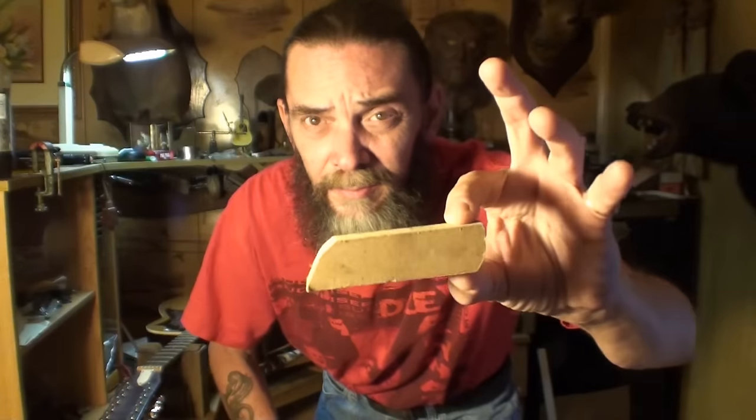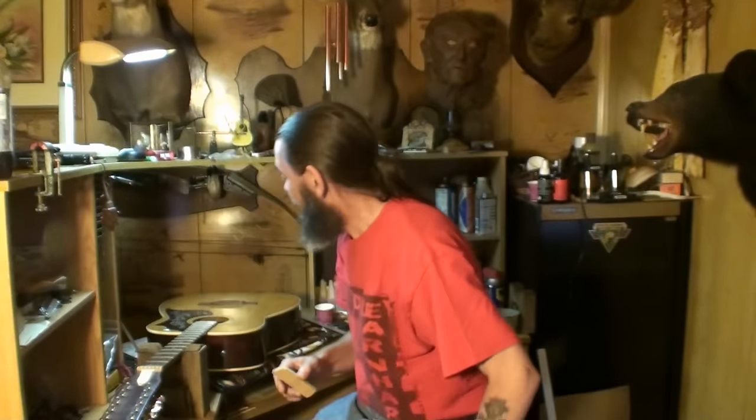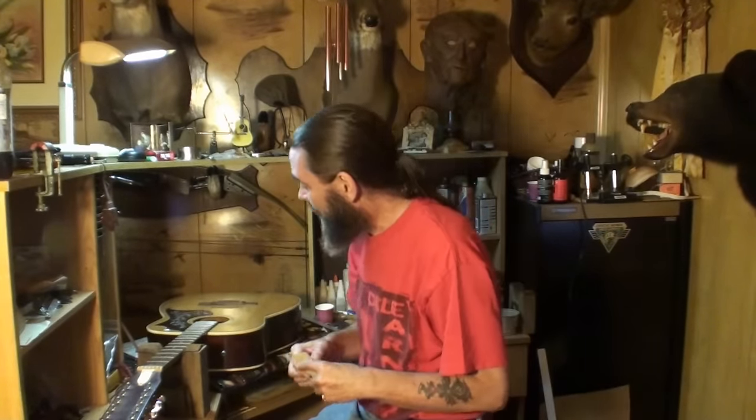I made a whole bunch of these one time. Some of you old subscribers have probably seen them before. You just set this end down on the brace that you want to glue, and then I kind of round it off up here, and you can prop it up against the brace on the top, or the other side if you're gluing braces on the top. We're gluing braces on the back today. But anyway, that's just like a prop, you know, and it smashes that brace together.